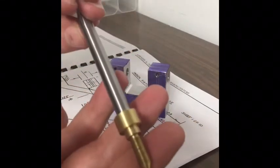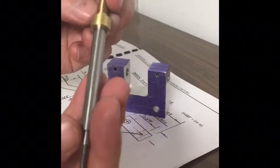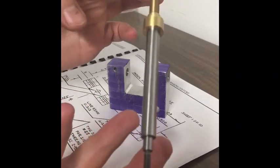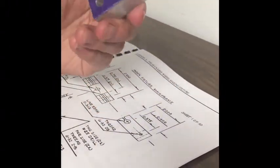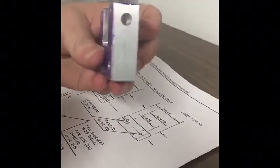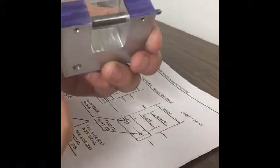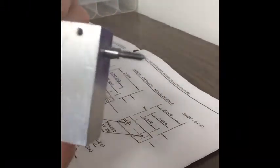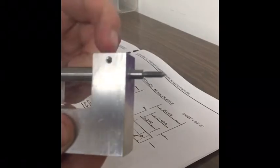The press fit called out in the plans is two thousandths of an inch, and that seems a little much. But it turned out really nice - it's pretty decent. The base is so far incomplete. I did put the hole through there, and this is where the shaft will go in. There's a little bit of space there where it should protrude out past.